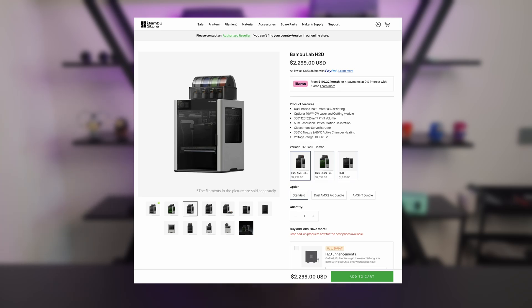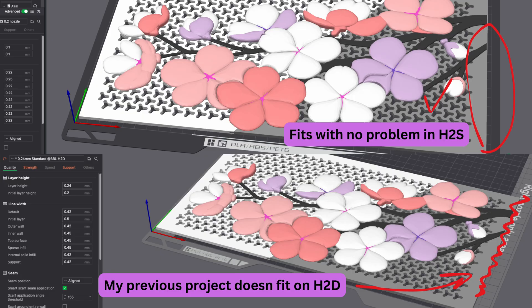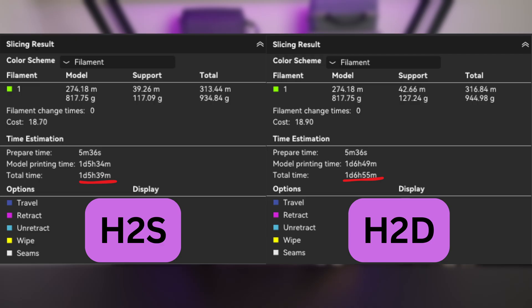This time it's different. We bought the flagship H2D — the most expensive printer — and then just a couple of months later Bambu released the H2S, which is cheaper, prints bigger, and prints faster. The H2D has a slightly smaller build volume, while the H2S comes in about 5% larger overall. When you're maxing out the print bed, that 5% really does make a difference. Because the H2S print head is lighter and simpler, you feel it on big jobs — something like a helmet print that normally takes a full day could finish 2-3 hours faster on the H2S. For multi-material or multi-color jobs the H2D can still be faster thanks to the dual extruder, but for straight engineering parts the H2S beats it. And the H2S is almost half the cost of the H2D — so not only bigger and faster, but way less expensive.